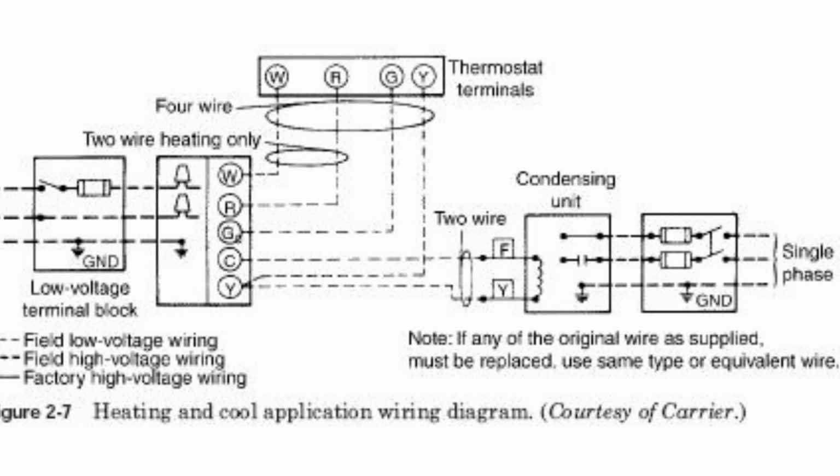You'll see a little area that says condensing unit. You're going to have C and Y out there. It'll still say common. It's only going to be 2-wire. It'll be red and white. Might be red and blue. Might be, you know, blue and green. It's just whatever they're using. One side will go to common. The other side will go to cool. And that completes the circuit.